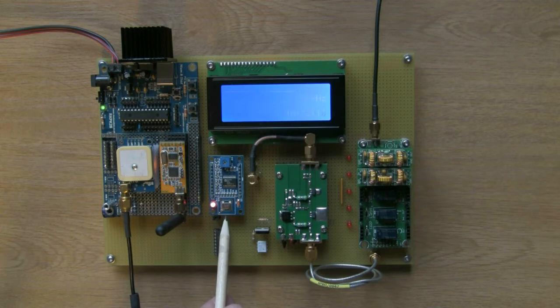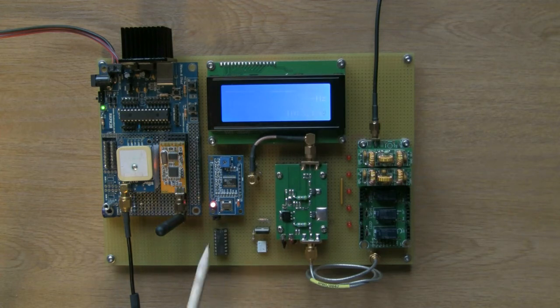That's its 125 megahertz reference oscillator, which, as I've pointed out, I think on another video, is the source of potential output inaccuracy, which is why I've added calibration into the software. Manual calibration to allow you to offset the frequency of the output of this module to compensate for the fact that this is probably woefully inaccurate. Well, certainly mine's inaccurate. I don't imagine if you bought half a dozen they'd all be inaccurate in a slightly different way. Okay, so that's cool.